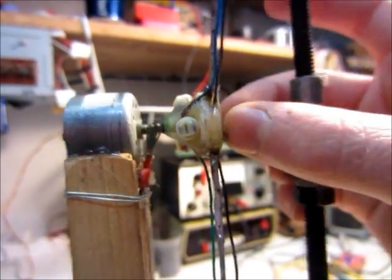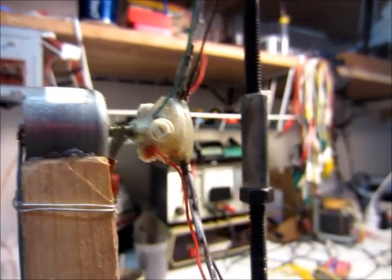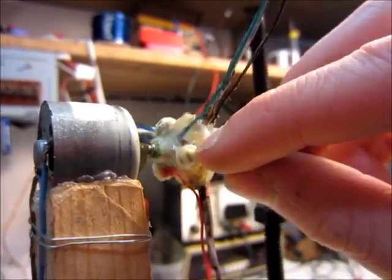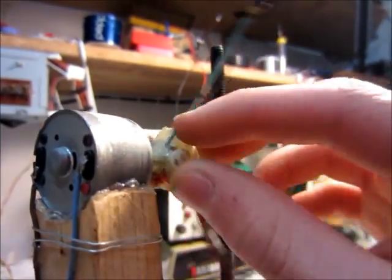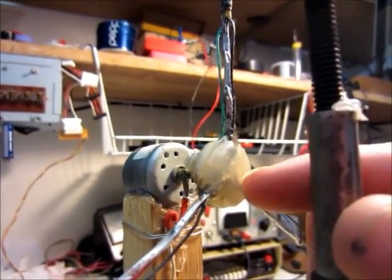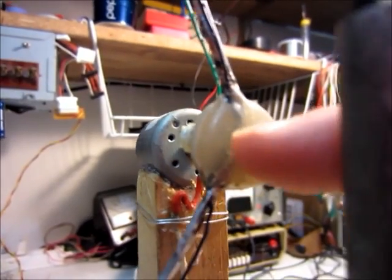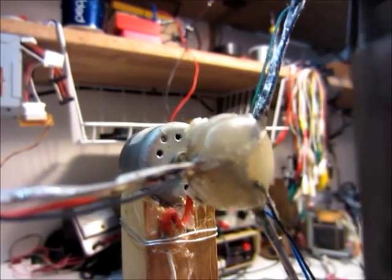Next I have a gear that I machined a little bit on the motor - I just took a razor blade and shaved it down until it was the right size so that it would fit these little potentiometers, or variable resistors. The way it's wired up is all of the LEDs' negative sides are connected to the end of the motor shaft - they're soldered right on there. That was actually a pretty hard thing to solder because the motor shaft took a long time to heat up, but if you have a high-wattage soldering iron, that shouldn't be too hard.